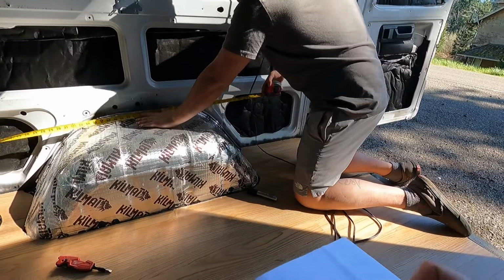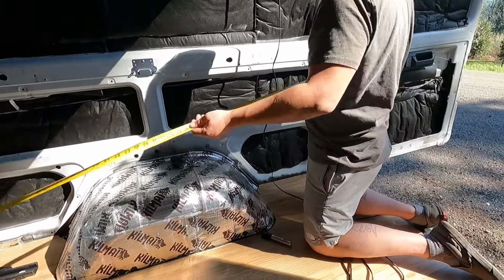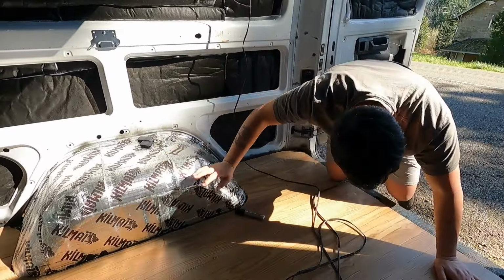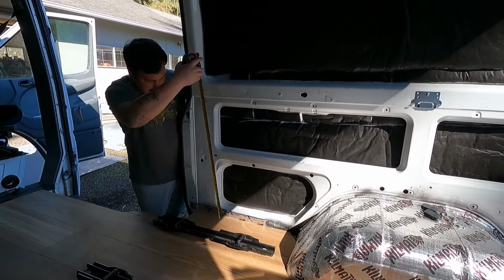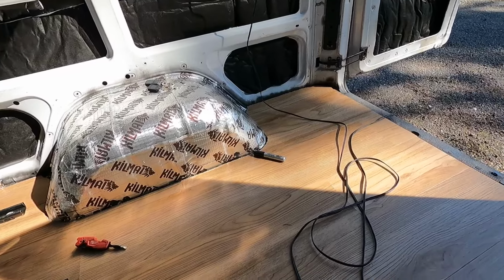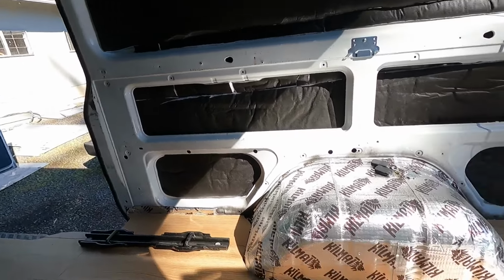So we need a piece. Well, all we need is to cut the half inch for right here, right now. So I already have the template out there that was on this wall. We just need the height from the bottom of the template up. Let's say 27 and an 8. Depending, I don't know what's in my shoes. What's it look like over there? In a quarter, so it's a little bit. So I think we definitely take... Well, I wonder if the floor goes down over there. Well, that little bit. So we could do 27 and 3/16. Okay. 27 and 3/16? Yeah.